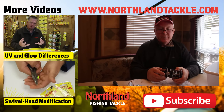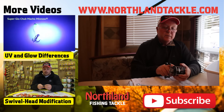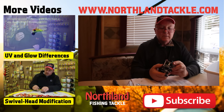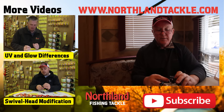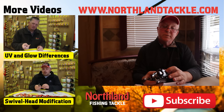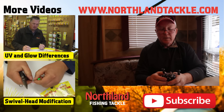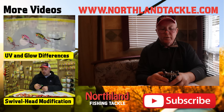To store them, back your drag off so it doesn't take a set. The only thing you need to do in the spring is to run that line out and get it to line up with the level wind again. Taking care of your reels like this will make them last a long time. The biggest, most important areas are to keep the worm gear and pawl lubed, keep the gears greased and grease underneath the drive gear for the spool and level wind, and on this end to take care of the main drive gear and keep it well lubricated — and it will serve you well for many, many years.